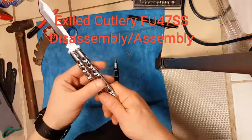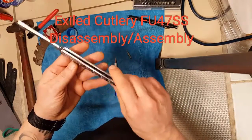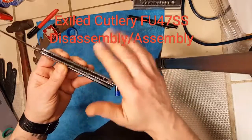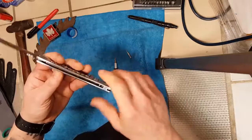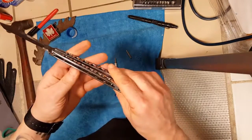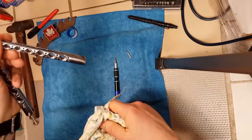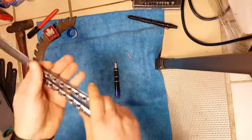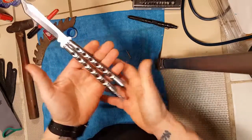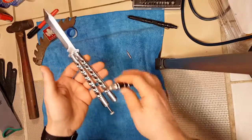As a kit it comes with a brushed finish, which is kind of nice, but the milling holes are full of grease and milling fluid — cooling fluid. The edges of these channels are rough, so you'll need to use a little sandpaper in between there. Be careful not to scratch the outside of the handle. It didn't matter for me because I have a bench buffer and gave it a mirror polish — feels smooth to the touch, but it's now a fingerprint magnet.